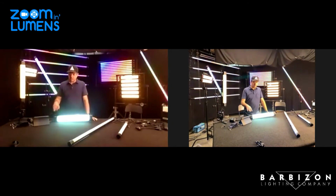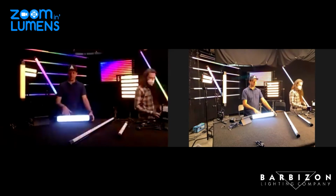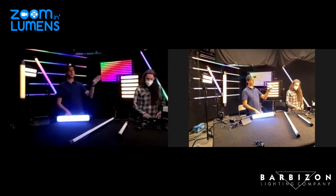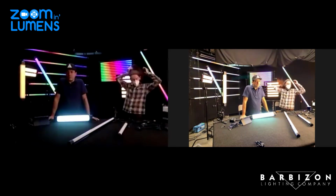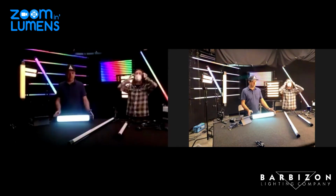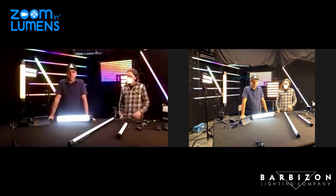The other wireless option that we're working on is Wi-Fi. So you can connect to the lamp as a wireless network. You can do the iPad to the light as a wireless network. Then you could choose to connect this to your own router for more permanent setups, if you have them in a studio or a home office or something like that, you'll be able to control them there. And then you can do ArtNet over Wi-Fi with an app like Luminaire or Blackout.